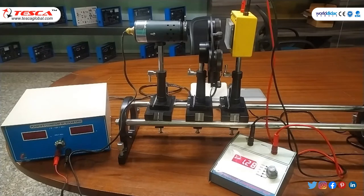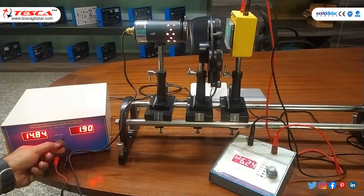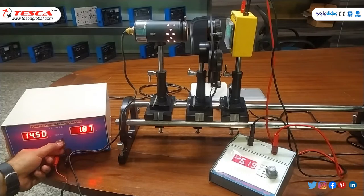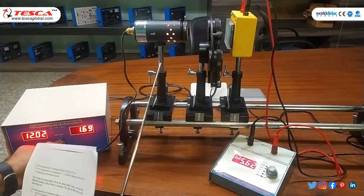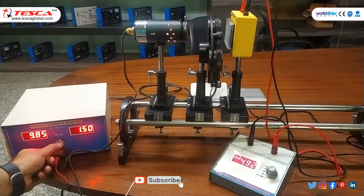For the first method — measurement of resistance of the filament at 0 degrees centigrade — we will first turn on the main supply and adjust the potentiometer knob so that the current in the bulb is very low. We gradually adjust the knob until the bulb just glows, meaning the filament appears dull red. Right now the bulb is at very high brightness, so we will turn down the voltage and current so that the bulb comes to just-glow condition.